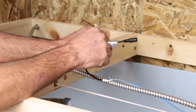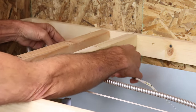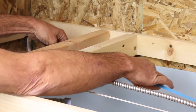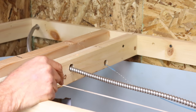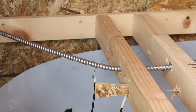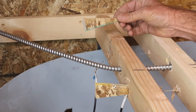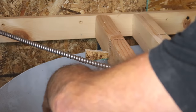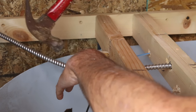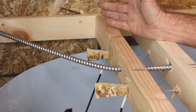I ended up using a 5/8-inch paddle bit so the connector can clear the hole, and then I stuff the strip through. To keep the strips right-side down and taut, I made wedges out of half-inch plywood — you put it in about where you want it and tap it in with a hammer. It just holds the strip in there really taut without seeming to screw up the LEDs at all. I'll go through and put these in all the way down and then let's take a look at the finished product.